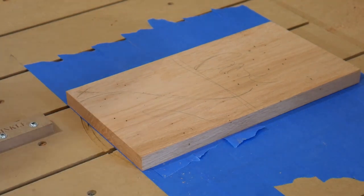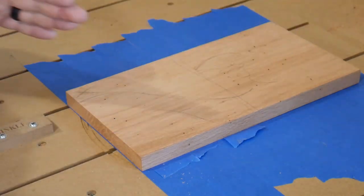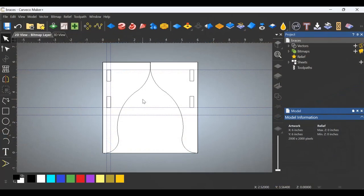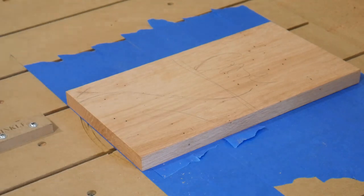On with the bases. I've added two mortises on the base — the base goes out like this. I added two mortises on the back side of the base, and I'll show you that on screen. Here are the two sides; mortises are right here and here. We need another half — you can't create two of the same sides, so use the mirror tool, mirror to the center. That gives us a left and a right. When you put it together it'll match up perfectly. Once I carve this out I'll flip it over and carve the other side.